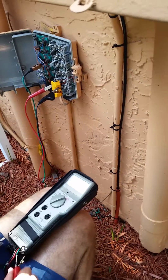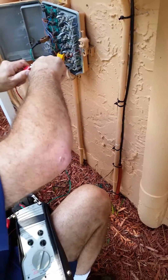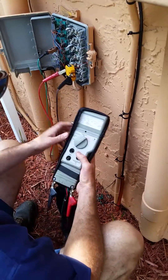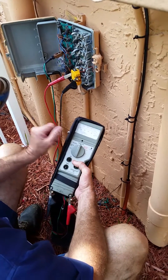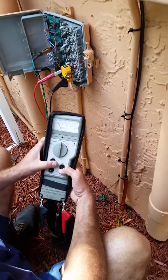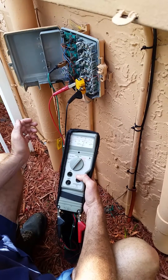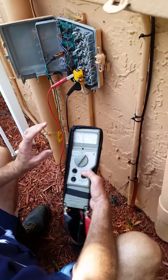Let me do my control here and calibrate — zero it out. When you get a good wire that doesn't have anything on it, it should stay around zero. The next test I'm looking at is for decibels on the line. Anything between 20 and 40 decibels is going to be noise or static within the human range of hearing. Right now it's not — but the last time I was here it was way up there, climbing to 40.